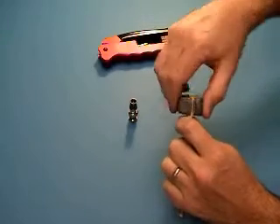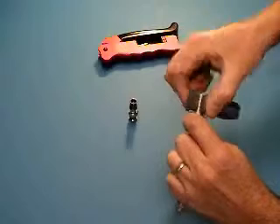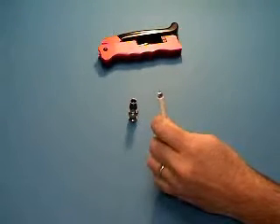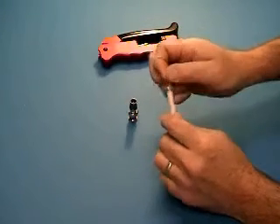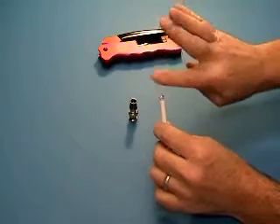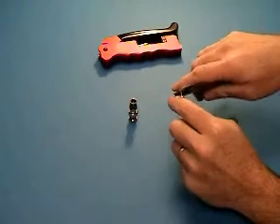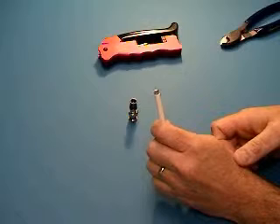Leaving the tool closed, spin it around while pinching it, and then to remove your slugs, grip the tool and pull — there is your completed strip. The center conductor is now exposed. On a solid copper center conductor, the cutting action of any cutting tool will generate a hook. Go ahead and trim off the last thirty-second of an inch on all center conductors to remove that hook.